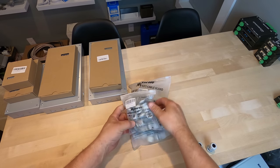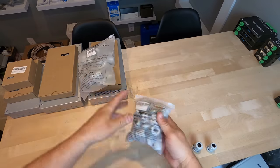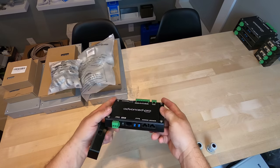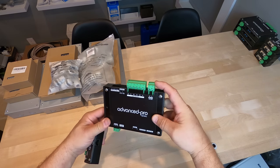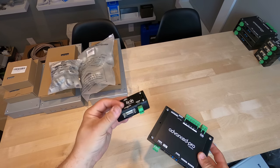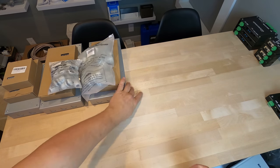The enclosure here is considerably cleaner. The cable glands come in a half-inch and a three-quarter inch knockout — half-inch is best for most things. The wire clips on it quickly. Quick overview: these are the power supplies we use for Epic Sky star ceilings, and the link in the description also covers the cable glands.